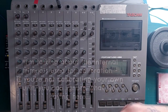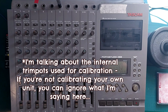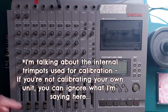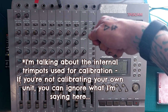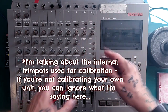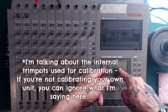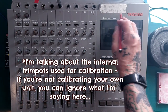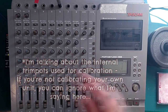What I tend to find with these units — I don't know why — but I rarely find that I need to turn down record amplifiers on an old machine. I usually need to turn all those record amplifiers up. There's even a thing I tend to do: I turn the trim pots fully to the right — as loud as possible — then turn it back a quarter turn. If I remember to do that, the levels are much closer to what I'd expect for calibration, and the adjustments needed after that point are much finer. Because I'm getting such low levels in most of these tracks, I'm inclined to think I didn't do that when I had this one open.